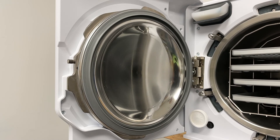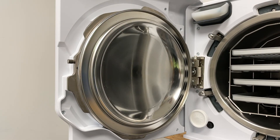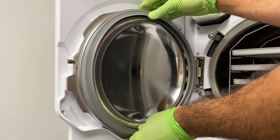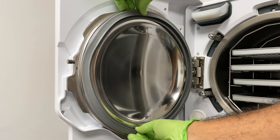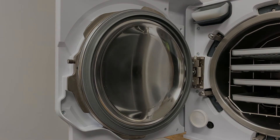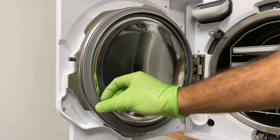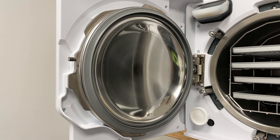To replace the used door gasket, remove the old gasket off the chamber door. Mount the new gasket starting at the 12 o'clock position, then 6, 9, and 3. Ensure the door gasket is properly mounted, fully seating into the groove. A door gasket not fully seated can cause steam leaks, sterilizer malfunction, and even personal injury.